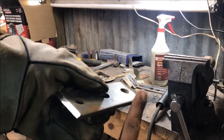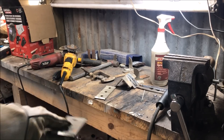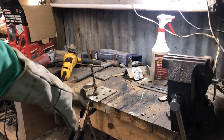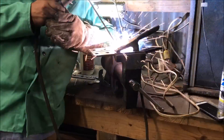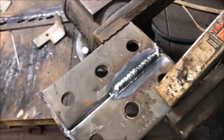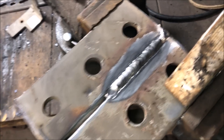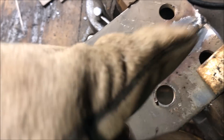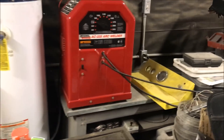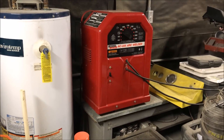When you weld thicker stuff you have to bevel the edge to get down and get a penetrating weld in there. 6013 1/8 inch, amps at 125, welding quarter inch now. First time in my life welding quarter inch steel — 125 amps, 6013 1/8 inch rod — and it looks pretty good. I guess that's what they call undercut — I'm not 100% sure, let me know if somebody knows. I might make a video when I learn a little bit more, but for right now that's it. If you enjoyed the video, please like and subscribe, thanks for watching.